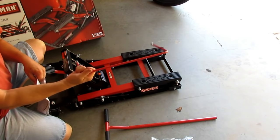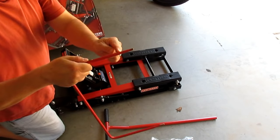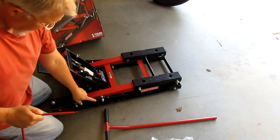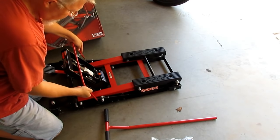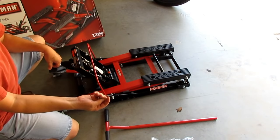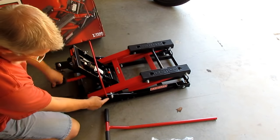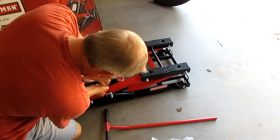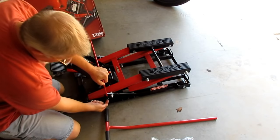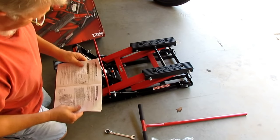This is the height lock release bar — it goes in here. There's a shoulder machined onto it, so make sure that shoulder goes all the way into the pieces of tube welded onto the bars. To get it in right without everything getting in the way, jack it up a little bit — you'll see it raises the bar and gives you some room to work. Then put a washer and nut on each end of the rod.